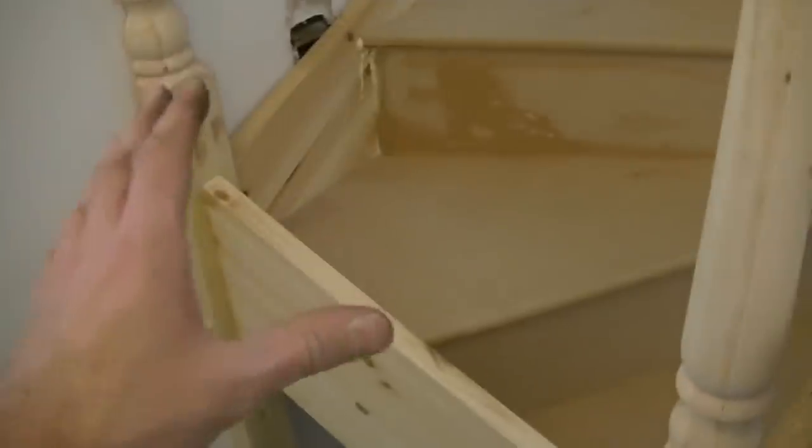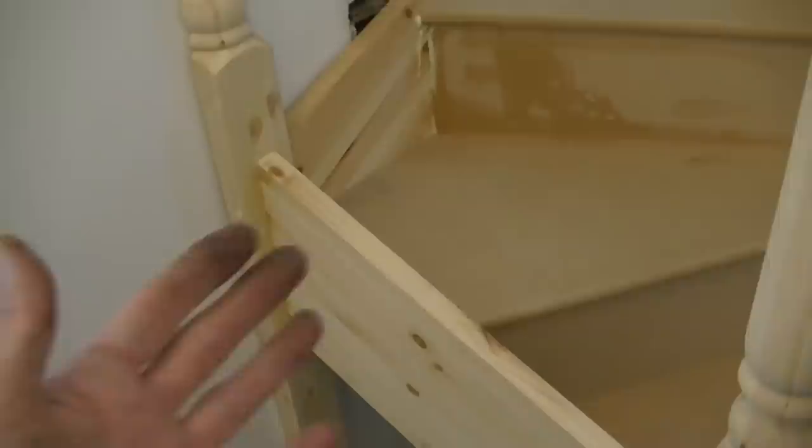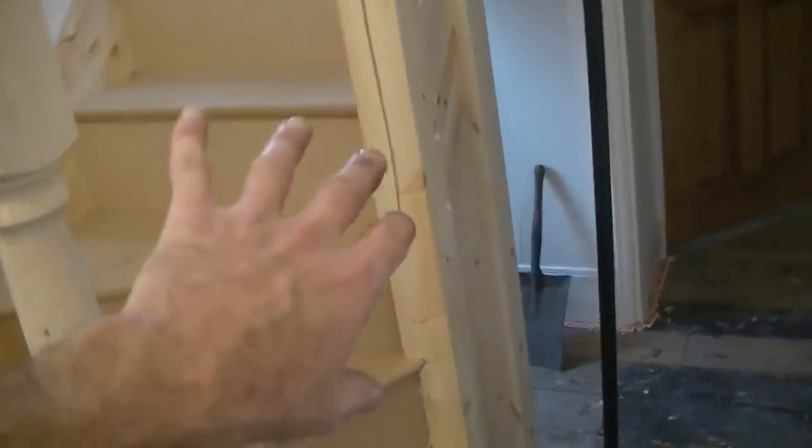Coming down behind this bullnose, you'll notice there are some blocks of timber there and there. What we did was screw down the top of those into the floor, and then screwed from the front of the step into those once it was in position, just to hold the base in place. Obviously this is recessed into this post because it was all CNC machined — that's nice and solid and holds this post up. This top half of the post is still loose, just sat in place. These are all things I've got to work out when I do the handrails.